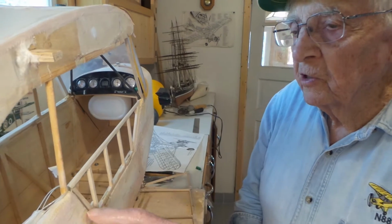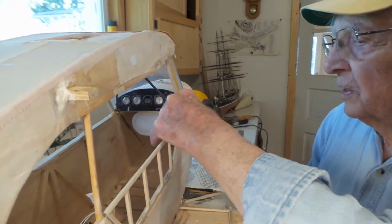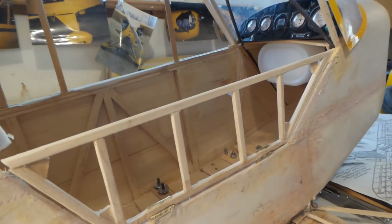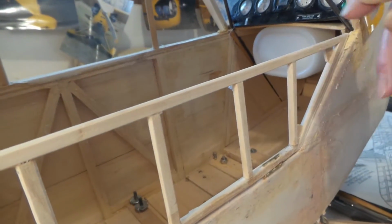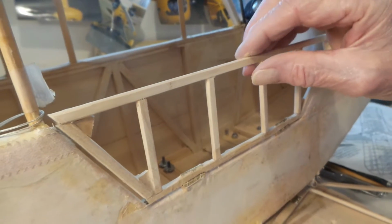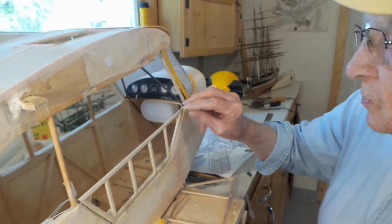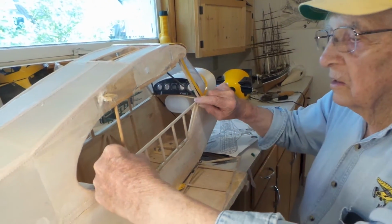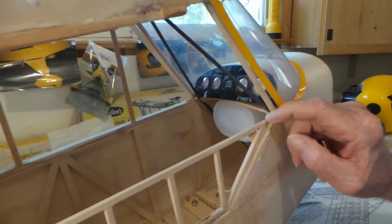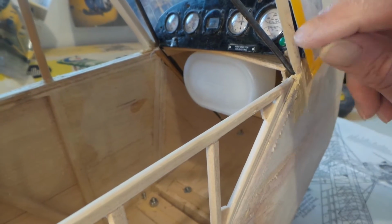Then you build the door on the template, and I used mostly dowel pins for this part of the door. I flattened the dowels out so they're rounded a little bit on top, and the center pieces are flattened a little to make the door thinner, with a bigger dowel so it's more sturdy, because you don't want it to warp. To get it to fit on this end and that end, you have to be careful so it's perfectly flat.